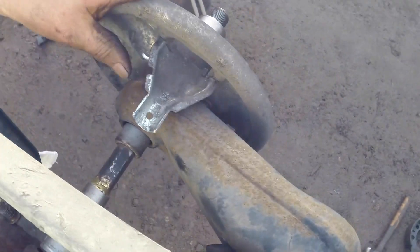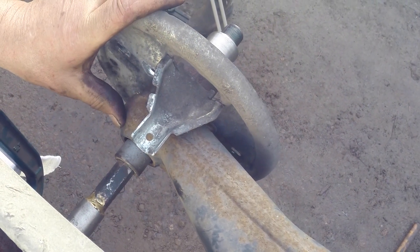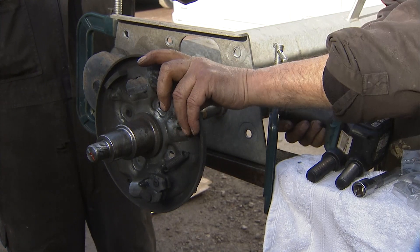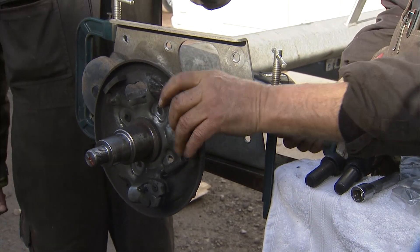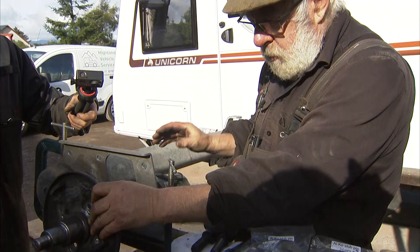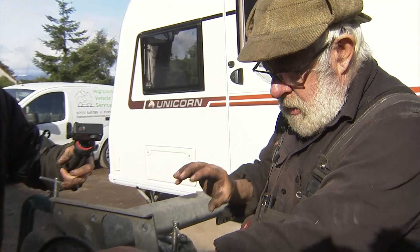This tool is a lot more powerful than it needs to be. The tightening torque for these bolts is 840Nm as recommended by the manufacturer, but they come loose every day — we get 3 or 4 calls about this problem with the bolts coming slack. So obviously 840Nm is not enough. This tool goes up to nearly 2000Nm, so we don't labour it — just give it 2, maybe 3 seconds at the very end of the tightening torque, and that is the job done.